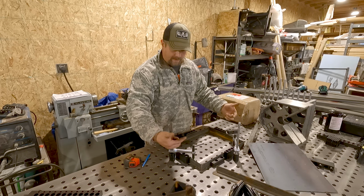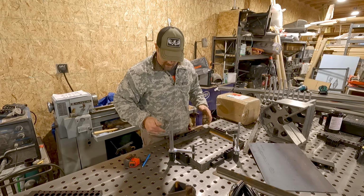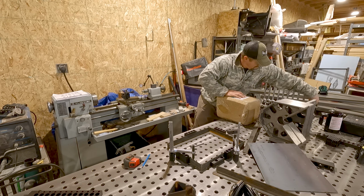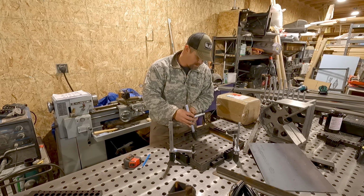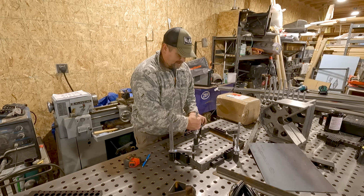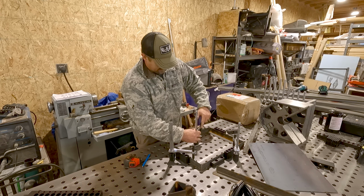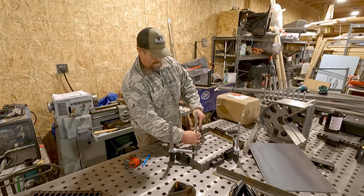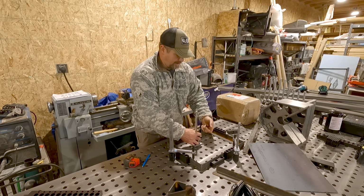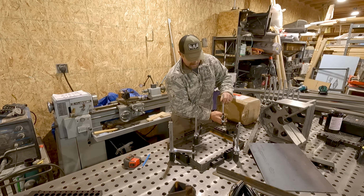And I won't weld the outside of the corner on the table until I take it off the table, just so I'm not spraying the table too bad. Some guys might be saying, well, I need to put more in here. Slide that clamp down a little bit closer. Could I put more clamps in it? Sure. But for what we're doing, not necessary. I'll do the last one on this.